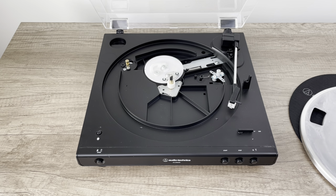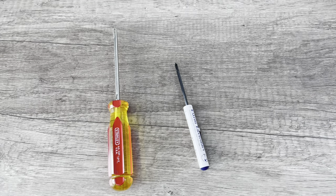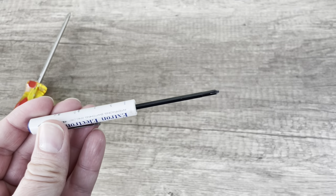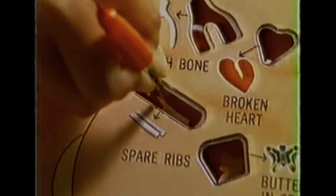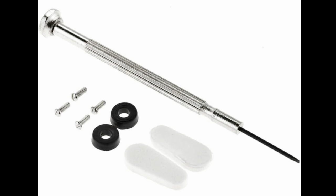So what tools do you need in order to make this adjustment? Happily, all you need is a screwdriver. Unfortunately, a regular household screwdriver is not going to work, and surprisingly, neither is a tweaker tool size screwdriver — those are both way too big. With a screwdriver that may physically fit through the opening, you will constantly be touching the edge of the motor casing, shorting out the motor, which results in the speed going to 100% on and off — it ends up being more like a game of operation. What you need is a very tiny little flathead screwdriver, one that's literally designed for this purpose and for replacing head shells. If you don't have one, you can go to your local convenience store and simply get an eyeglass repair kit — that size of screwdriver will work as well.